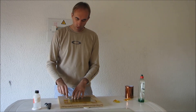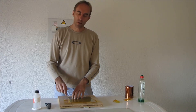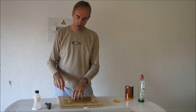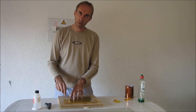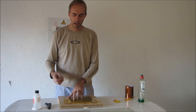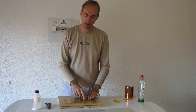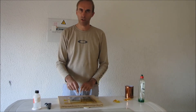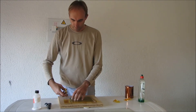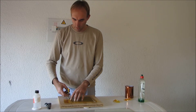One thing I like to do is in this region where the Kapton is — this is obviously where the electronic contacts come for your heat bed — I like to leave the Kapton tape there and actually fold it underneath rather than cutting it all flush. Just a little bit of extra insulation where you've got a conductive surface near fairly high current.